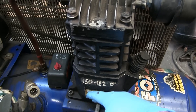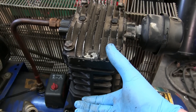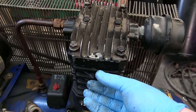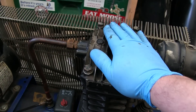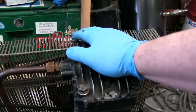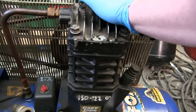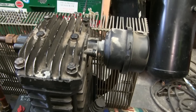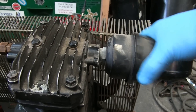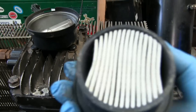This is splash lubricated, and the head especially gets hot because you're taking a column of air and compressing it — the heat that was in this column is now in this tiny little column, which heats up the air. You need good airflow; there is a fan. If you want these things to last, put an external fan on them. That's really all there is to it — some air filtration to keep debris out.